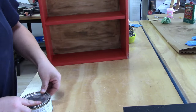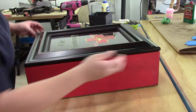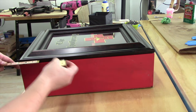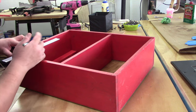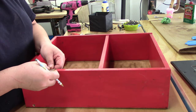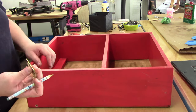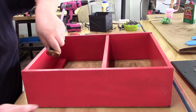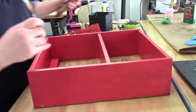The next move is getting the hinges on. I purchased brass hinges and I'm going to install them on this end. I'll give myself a measurement on both the side of the frame and the side of the box — I'm going to do three inches on either side. I am going to be recessing these hinges so that the door sits flush. You don't have to do this — it involves chiseling — but if you just attach the hinges to the outside, you'll end up with a gap. I'm using my Veritas marking gauge, which is really handy — I set it at the depth and it scores a line. Then I'll just chisel out that little section.